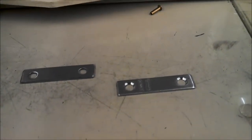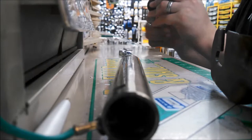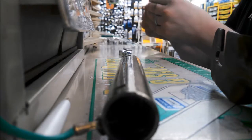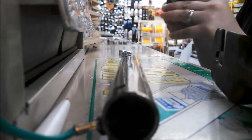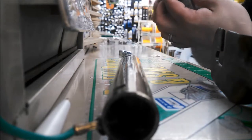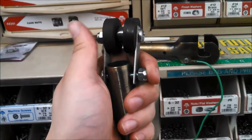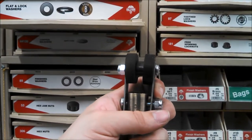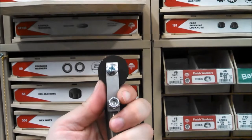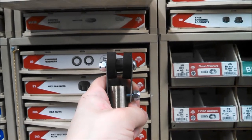What if you've got a down rod that doesn't have the claw? All you need is two of these little small mending plates. The largest bolt that will fit through the mending plates is quarter-twenty, so I've got a quarter-twenty here, and then a quarter-twenty stop nut. You tighten everything down, and that way you have everything you need to hang a fan on a J-hook, just from parts from the hardware store. Thanks for watching.